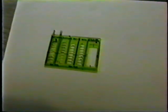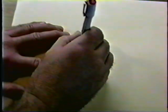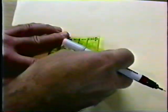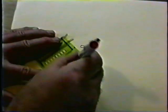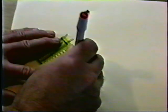Another thing Frank McMillan had a great idea, or passed along a good idea, was that just before you ink the plane, wipe it with talcum powder. Now because the template is not touching, we can peel that up and we have a perfect little line. If we wanted to do two of them, try to hold the pen straight up and down, put it down on the paper, make your line and get it off the paper so you don't get a blob.